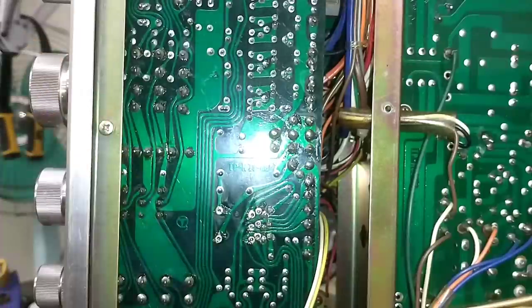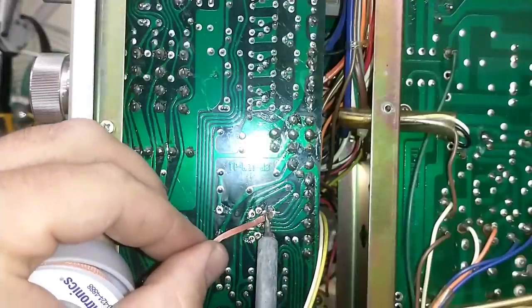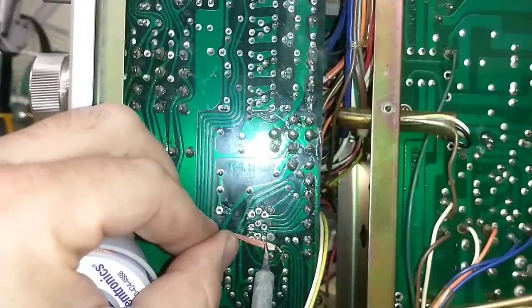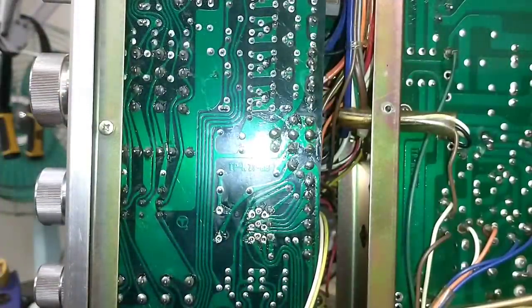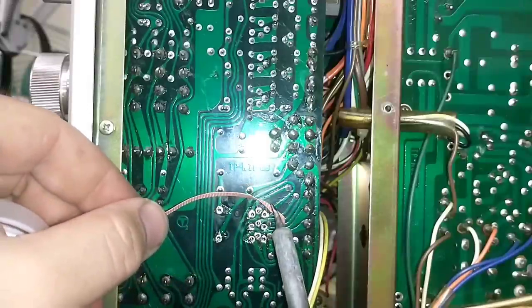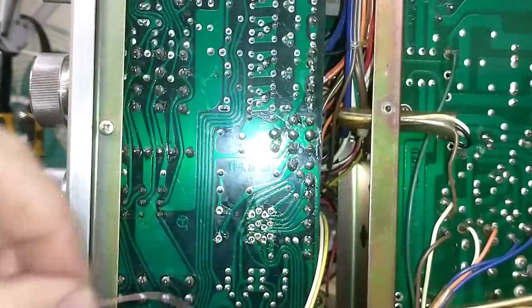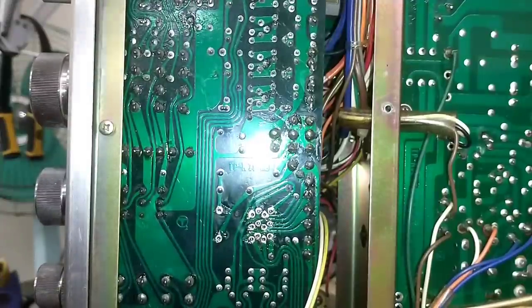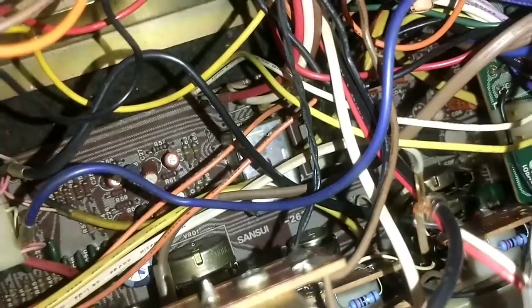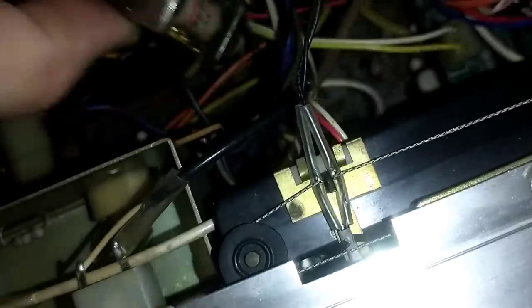I believe Elna made these boards for Sansui and they're not the greatest. Don't ever try to do this with a 30 watt iron, don't ever try to do it with a giant tip. This tip is about on the verge of being unacceptable — it's a little bit bent and worn out. But we're just going to go real quick, get all the solder off that we can. And now that should just come right out — it just comes right out like that.